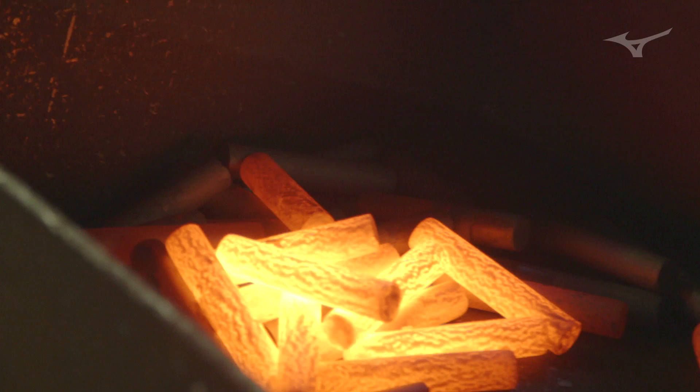With the grain flow forging process, it's a little bit different than a traditional forging. We start by taking a 1025E pure select billet of mild carbon steel. What a billet is — it literally is just a piece of metal, an elongated cylinder of metal. We'll take that cylinder and put it through a bending and stretching process.